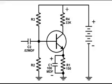To the left of the transistor is R2 and R3. This is the voltage divider circuit that makes up the biasing network for the NPN transistor. And in the mock-up, those are actually 4 resistors. R2 is a 100 ohm resistor and then a 100K ohm variable. R3 is a 1000 ohm resistor and a 100K variable.